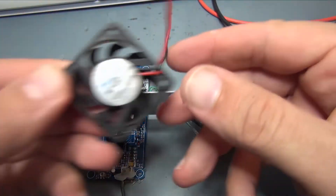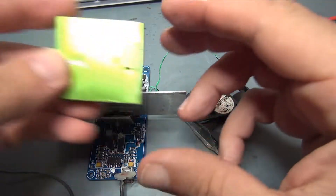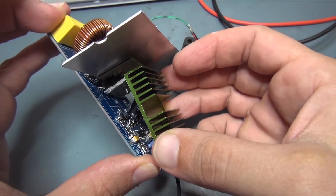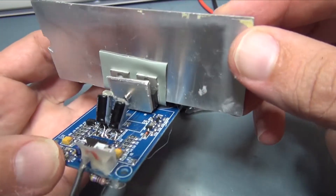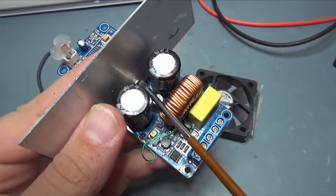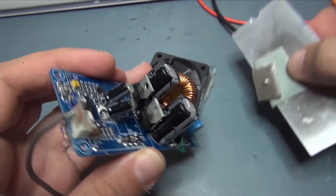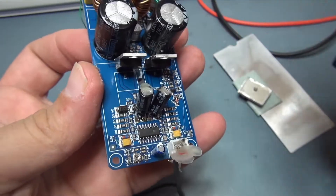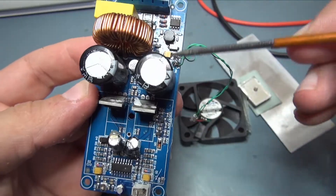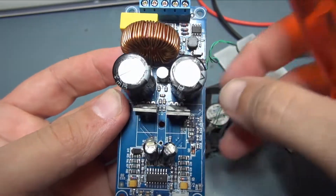I changed the dead components. The big plate you can see here is the new heatsink, because the new capacitors didn't allow me to keep the original one after the repair. I also changed the fan because the original one was very tired and dodgy. It's a slightly different fan, but the original was not adequate to cool such a small but powerful amplifier. You can see the two capacitors that exploded, and here is the main diode that supplies the integrated DC-DC converter to provide 12V to the fan. Fortunately, there are a lot of protection diodes surrounding the IC, which saved it.